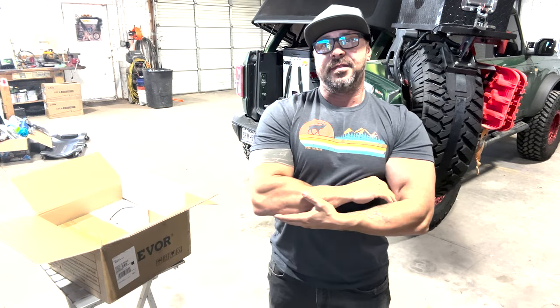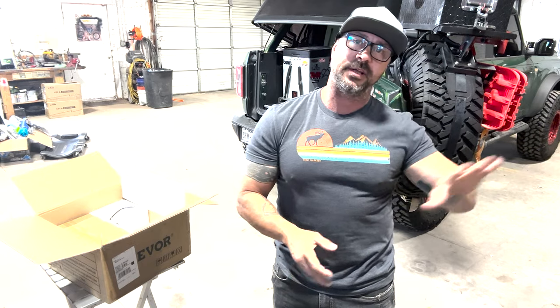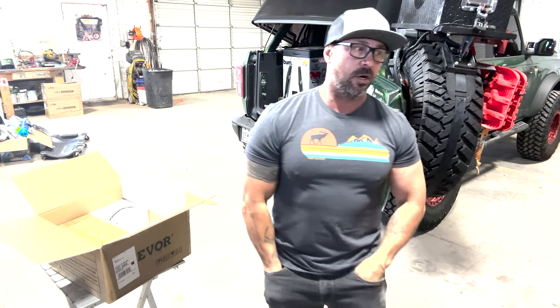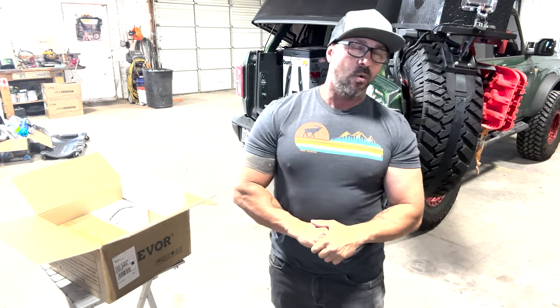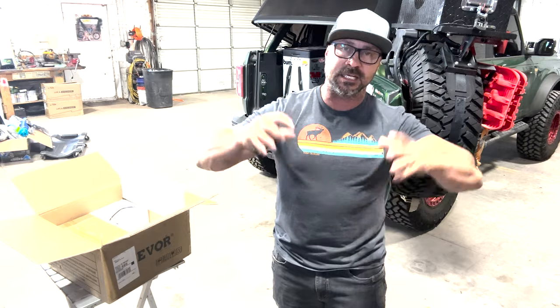And then the next morning when I'm getting up, I'll point the vent towards the door in this specific application in the camper, and I'll turn it all the way up again and let it burn off anything that kind of collected over the night. And I'll let that run for probably 15 minutes. That way every time I turn it off and it physically cycles off, we've cleaned that burn chamber the best we can on every use. And that's what you need to do.